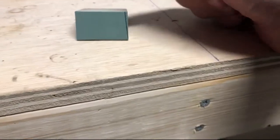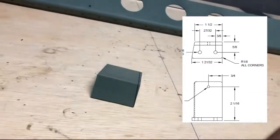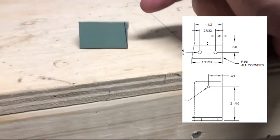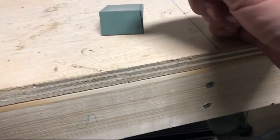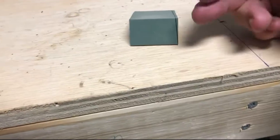All right, I wanted to show you guys something. We have to mark these dimensionally, and I'll put it in the plans or here somewhere. There's a product that we usually use in the machining industry called Dykem. Dykem is a bluing compound. You put it over it, and then you can scribe your marks and put your marks on it. If you don't have Dykem, just take your primer paint and shoot your primer paint on that, and then you can use your caliper.